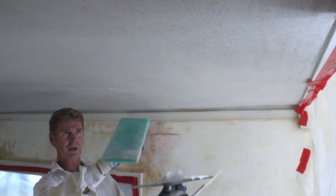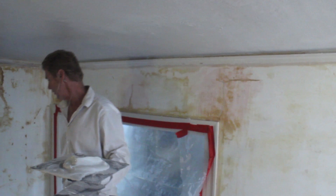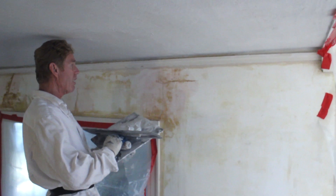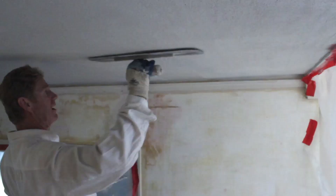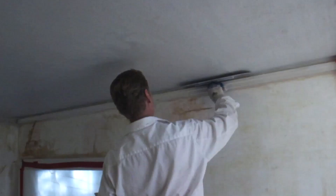Before I start the diamond or skim coat — as they call it in the UK — you can float it or texture it, but it'll always have a little grainy look. That's not sand — you plastering folks know what that is. It's volcanic rock, crushed rock, and that's what gives it so much strength. In fact, this is one of the most soundproofing plasters there are.